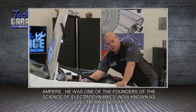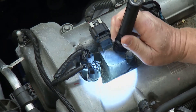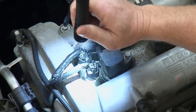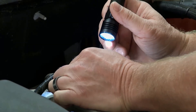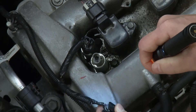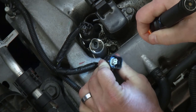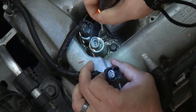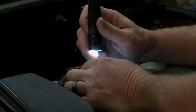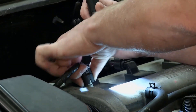They're oil actuated, so we're looking for any obvious oil leaks down around the housing here. I don't see any. So the next step is to pull the connector. It's not brittle, nothing's broken. We want to get a good look at the terminals in here and check that the copper's good, nothing's bent over. Same thing down on the top of the solenoid valve itself — nothing obvious there. I'm going to button this back up; we don't want any contamination to get down in there.